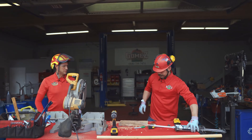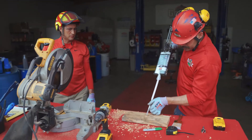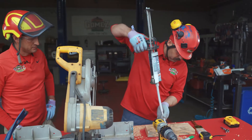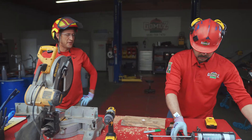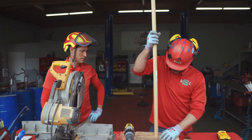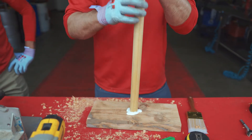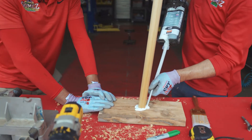So now I'm going to get my epoxy. This is a standard epoxy from Home Depot. We're going to fill in the reservoir with epoxy — about 60% fill. You're going to then take your rod and push it into the hole. As you can see, the epoxy now comes through the sides. That's really going to help it bind and lock everything in place. What I like doing is adding a little bit more around the perimeter, really reinforcing it.